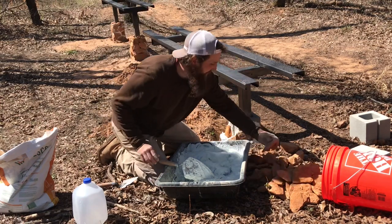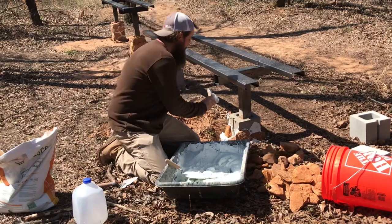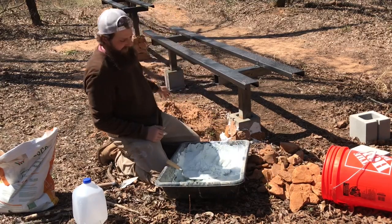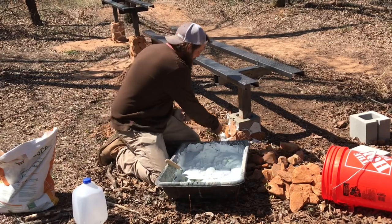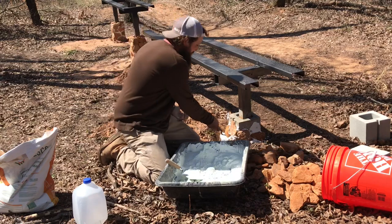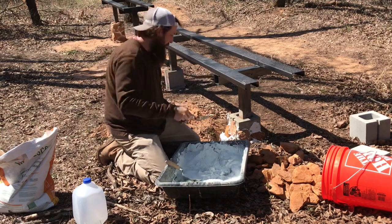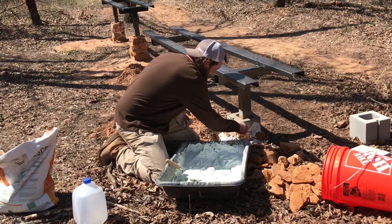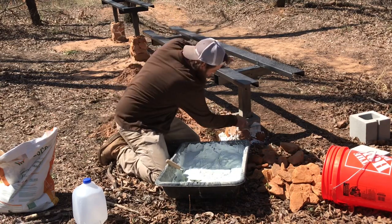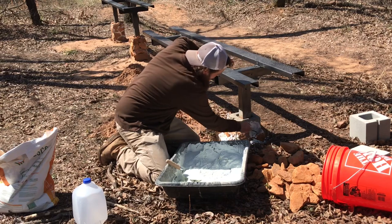This is a medium thickness rock so we'll put it on the second level. Just stick it right there and kind of twist and turn it until it looks right. Notice I've got a small trowel here. You can take this and do what's called pointing — where you fill the gaps. If you don't back-butter it enough for it to squeeze out, you can fill the gaps with the smaller trowel. Or if it does squeeze out and you want to clean it up, you can scrape off the excess. It also helps when going to the second level if you make a small bed of mortar on the stone below it — it makes that line defined when you do the next layer.